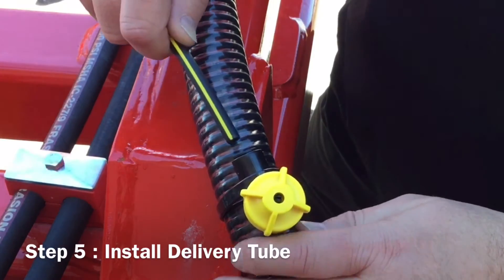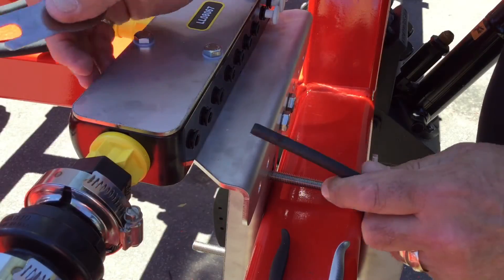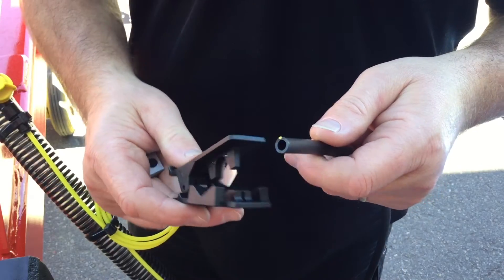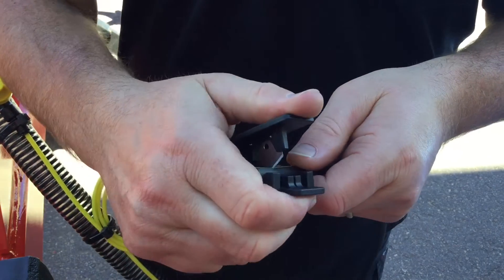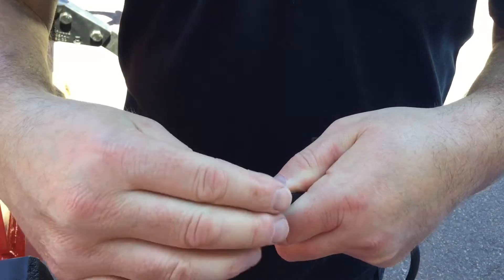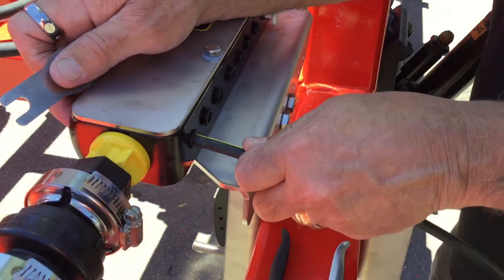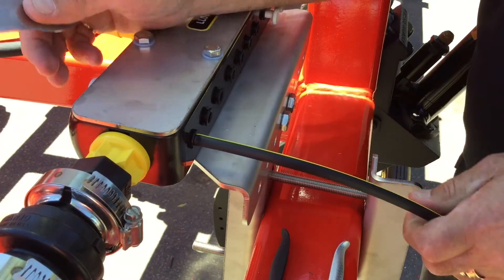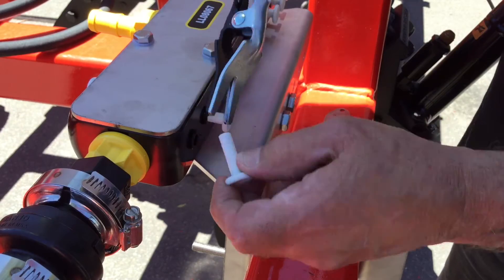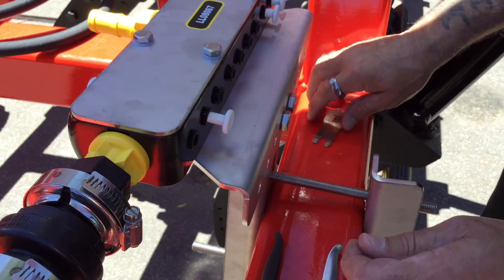Now connect the terminal assemblies to the manifolds, ensuring that the delivery tube avoids kinking or crushing when your implement folds. It is really important when cutting the delivery tube to always cut with the supplied tube cutter to ensure clean, non-distorted tube ends. Also chamfer the cuts with the pencil sharpener provided to allow easier fitment and to push in fittings. The extraction pliers can be used to remove plugs and line meters, or the compression tool can be used to depress the collet of the push-in fittings.